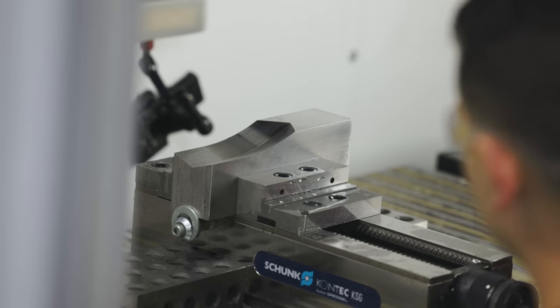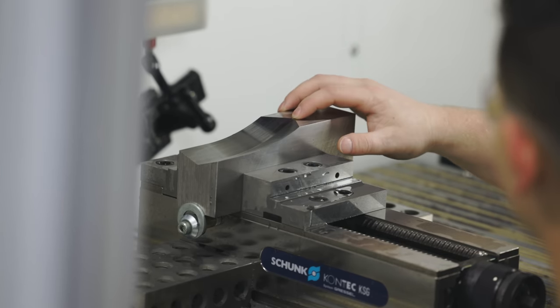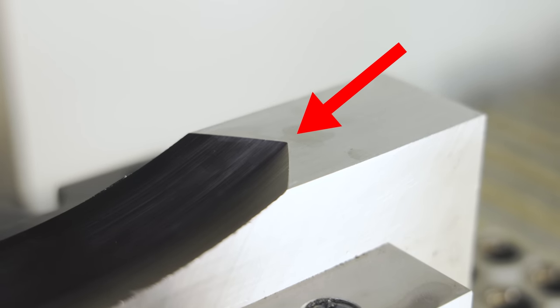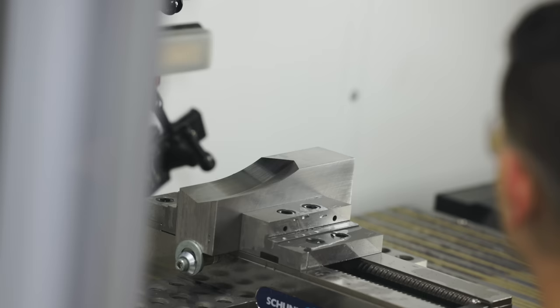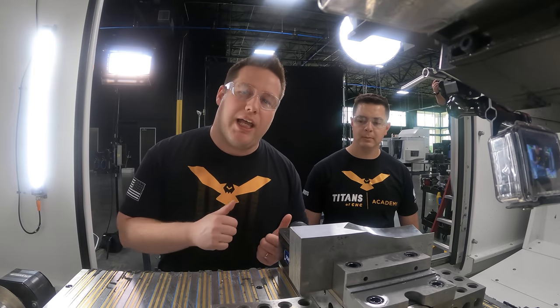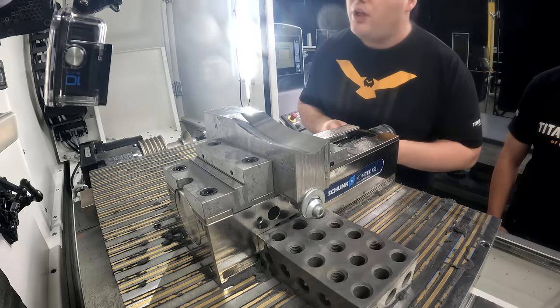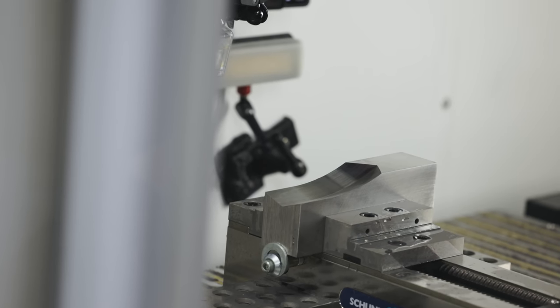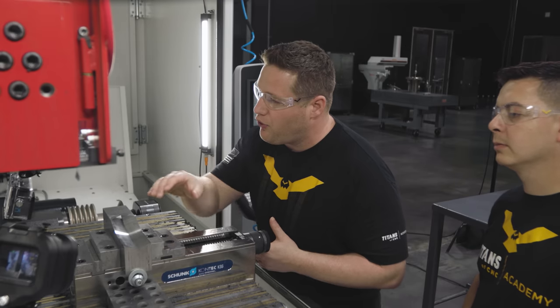Check this out right here. I got a lot of comments in the last video asking how much the wheel actually breaks down and how long will it last. If you look at this part, we took a huge cut — there's a lot of material that came off. But if you look at the top of this material, the small radius I put on the wheel is actually still there. You're not seeing a big deformation in the contour of the wheel. I was also getting questions about why we were redressing between cuts. The question was, doesn't the wheel resharpen itself? The answer is yes and no. As the wheel cuts, the edge will get built up and flake off revealing a new edge — so it's like it resharpens itself. But when you're taking a cut like this, that wheel is going to continuously load up, and if you don't have a continuous dresser while it's cutting, it's going to start getting dull. That's one reason why we stopped it short — to keep the wheel from loading up and burning our material, plus I wanted to show you just how deep this cut is.